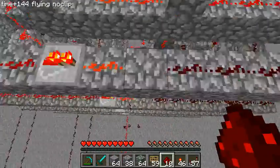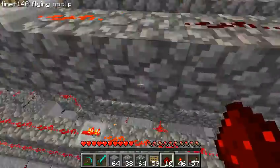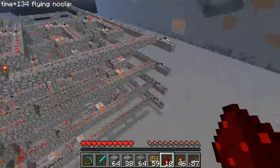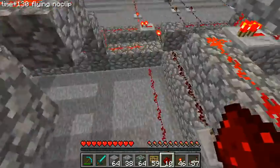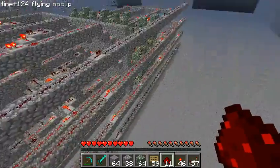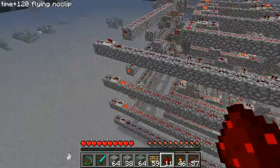If I modify the results here — so we've got 3 plus 3. You can see this bit here, it equals 6. And nothing is put onto the return bus unless we tell it it's doing addition, in which case the number 6 is put on the return bus. And 6 is 0110.